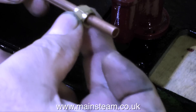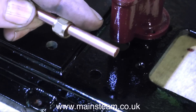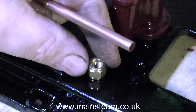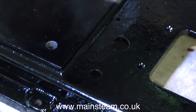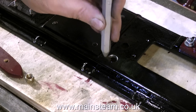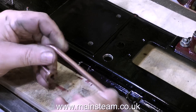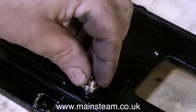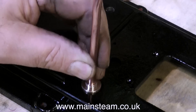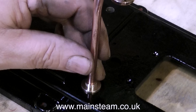The reason for the pressure fitting is that the pump will be under pressure when the engine's running. So I want to make sure that I have a pressure tight water system, because you never know whether or not in the future anyone's going to use this engine for actually pumping water. The nut does not fit in the hole — I need to make it bigger. So obviously I'm going to drill a hole with this twist drill, followed by deburring the hole with a deburring tool. And now the nut fits through the hole. Before soldering on the pressure union, I made this small brass fitting. This fits into the hole on the bed plate, and the pipe passes through this fitting. Then with the fitting in place on the pipe, I silver soldered a pressure union onto the end of the pipe, and the whole thing passes through the bed plate with ease.